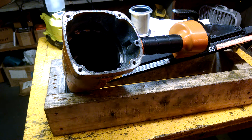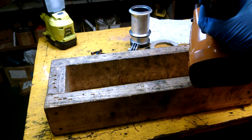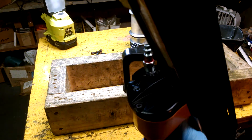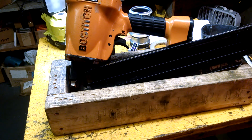After you put a few cases of nails through a gun, it's time for an O-ring kit. You need oil in guns. In any case, read the instructions, look on the base, and use this thing called the Internet if you don't have your instructions. I know most people have the Internet and that's probably how you're watching this video. Anyway, a little bit of sarcasm. Hopefully the video was fun. Hopefully it was informative. Have a great day.